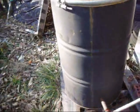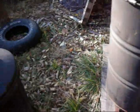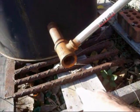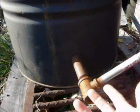From a cold start with just regular charcoal — I pulled the top off to check how much I had in it, because I haven't filled it up since last year. It sucks the charcoal: when charcoal burns, you're only letting a little bit of air come in. You can see the smoke coming out of it. What happens is, it sucks a little bit of air and it's not enough to burn it completely, so the gases that come off are not completely burned — it's like pollution basically. But the pollution is carbon monoxide, hydrogen, methane — that kind of stuff — and all these gases are flammable.